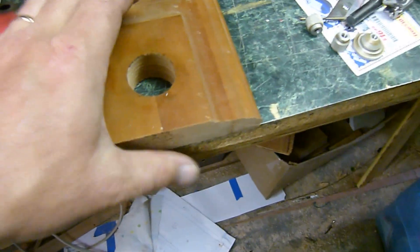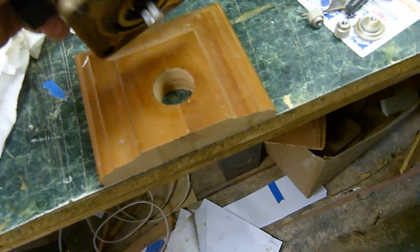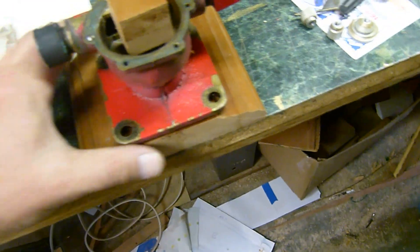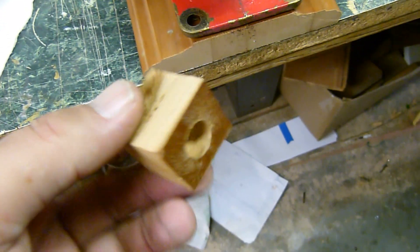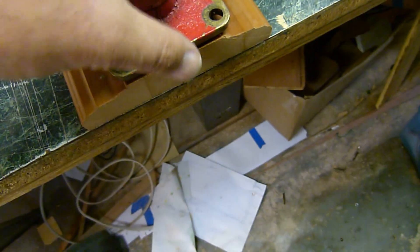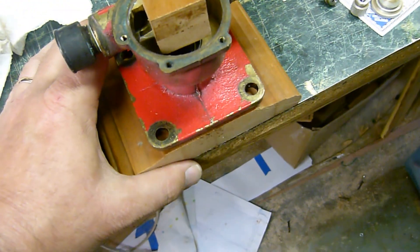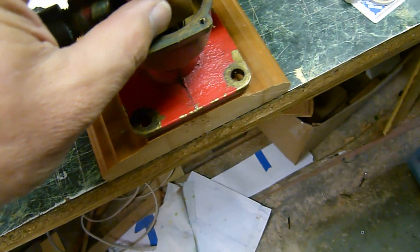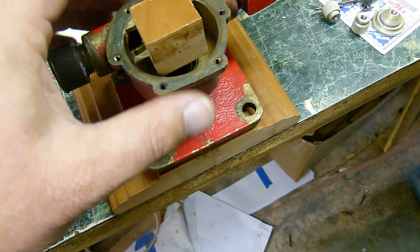Here's the board. It's got a hole drilled in it, and there's the bottom with the bearings. The bearings will fit in that hole, so we're going to center this right like this, and on this side I've got another little block with a board in it. I'm going to set that right on top there, and then we're going to get a big clamp and squeeze this right down. It should push that right out into the other side.